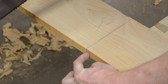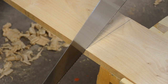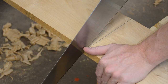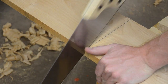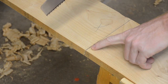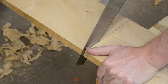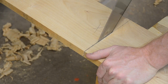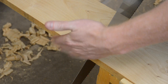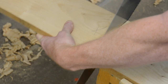I don't have a line drawn to establish whether the cut is perpendicular, but a trick with a newer saw with a shinier saw plate is that as I move the saw, you can see the reflection adjust. I use my eyes to watch that reflection on the saw blade — once it lines up, I know the saw is square. I'm still cutting just slightly proud of my line because if that line disappears, you lose your frame of reference. For the last part of the cut, it's important to support the off-feed piece with my hand — just slightly, not enough to pinch the blade.